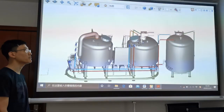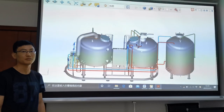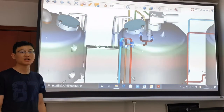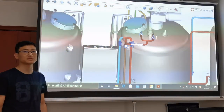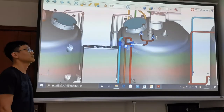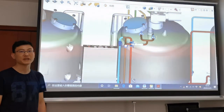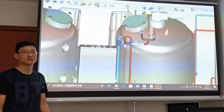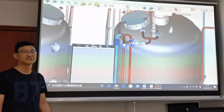There is a water mixing station installed before the mash and lauter tun. You can adjust the mix levels to get the water temperature that you want. There is a temperature sensor installed to indicate the mixed water temperature, and also a flowmeter to record the total volume of the mixing water.